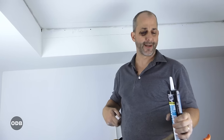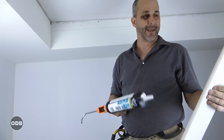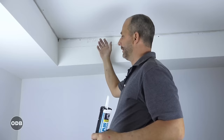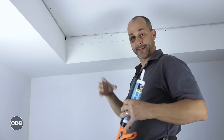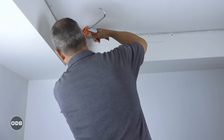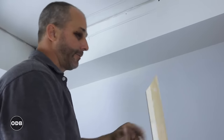Generally speaking, when I'm doing crown molding, I love to have my teenage sons help because they're tall and don't need a ladder. But it's nice to have someone holding things in place. The reason I pencil mark this is so I can put my caulking on the wall and on the ceiling in advance. So many years you get calls — the crown molding is cracking, it's all falling apart. What you find is guys cheat — they come up and nail it all together with little brad nails, they don't use an adhesive, they use a surface caulking line that doesn't have any elastomeric property, which means it doesn't expand and contract. The wood's moving around but the caulking isn't, and there's not enough there to bond it to the surface. So I like to put some caulking on just inside those two pencil lines. If I put too much, that's fine — we're going to move it out of the way. We haven't painted yet anyway.